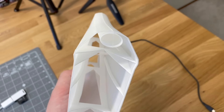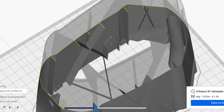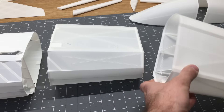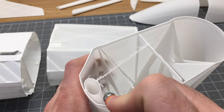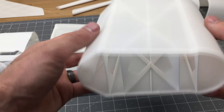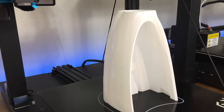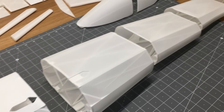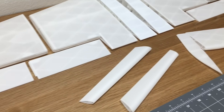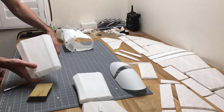I just uploaded a video about my lightweight PLA settings, so check out my channel if you're having problems. The lightweight PLA parts use minimal extruder movement — virtually no retractions — so there's very minimal stringing. You can clean up parts with an X-Acto blade. The regular PLA parts use traditional retraction methods, so make sure your retraction settings are dialed in. Once all parts are laid out, a little sandpaper and X-Acto work ensures good fit and glue adhesion before assembly.